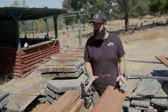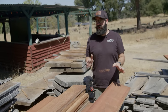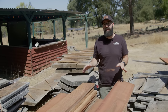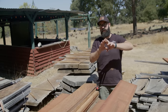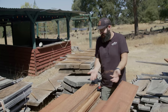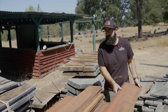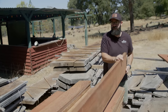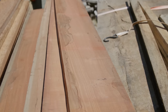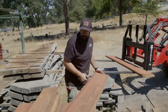I'm down here picking out my wood. I'm looking for really wide planks — fortunately most of this is really wide. I want to get pieces with a lot of nice character, mostly for the hand rests and visible parts like the long rails and the legs. I'm also trying to avoid a lot of checking. There's some checking on the edge here but it doesn't continue far in, and I'm going to need to cut this down during the milling process anyway. This is going to be a good board to use.